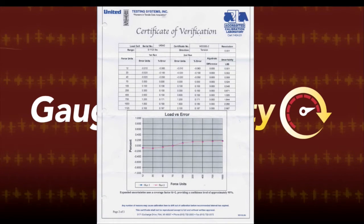So what I would suggest he would do would be to take a measurement below the range. He's looking to start at 7, so possibly check it at 6. Do at least a 3-point check, low, mid, and high of the range he's proposing to work within. And that's what he did, right? And that's what he did. He did a number of tests at 5 pounds, 6 pounds, 7 pounds, and he documented them out.